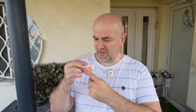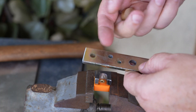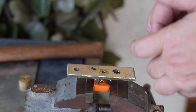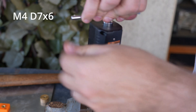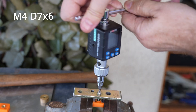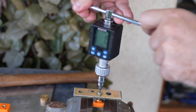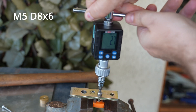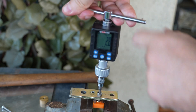I'm not finished yet — I also have one M4 and one M5 threaded insert to test. These are steel, so the friction is a little bit bigger, but I placed some grease on them. The M4 result is 1.9 newton meters. And the M5 result is 2.8 newton meters.